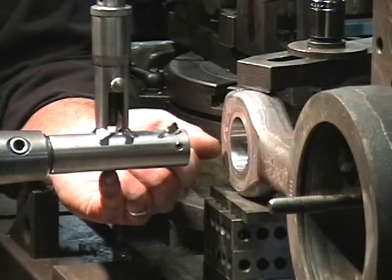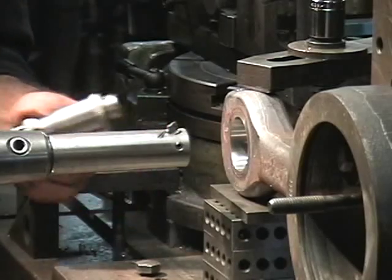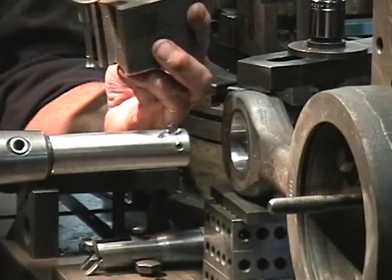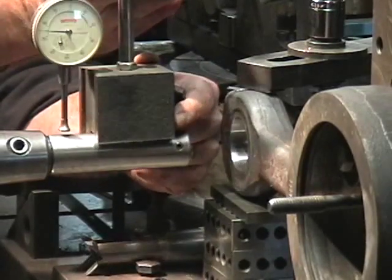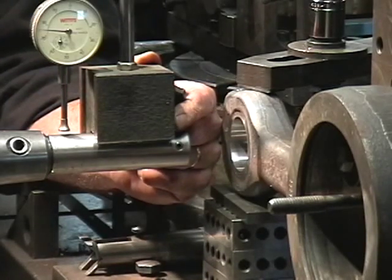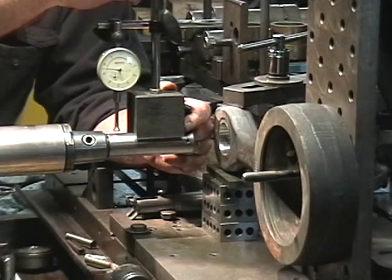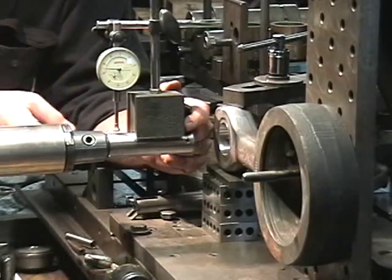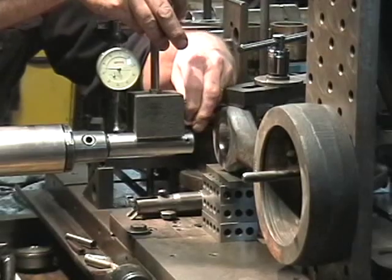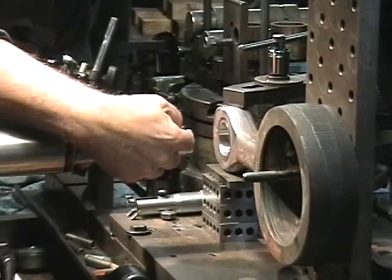You just push the tool up to it if you don't have a tool with a backing screw. Some people will set these with a mag base — set it down on the bar, roll it over the tool, back it out some more, lock it down and then adjust their tool. Some have setting gauges they put on their table and they'll just run an indicator out to the bar in this direction.